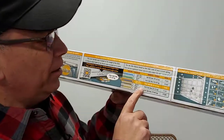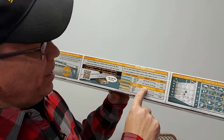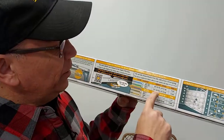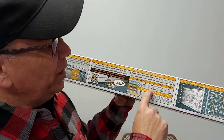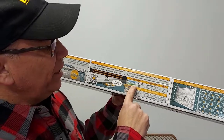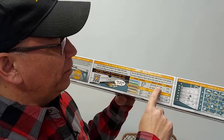I did that — my garage doors were around 140 pounds. Once you weigh your door, you can go online or just go by this video. Mine was 140 pounds, so it takes a dark blue spring. If you have a door that is between 115 and 125 pounds, it'll take a green painted spring. If you have a door that is 85 to 95 pounds — must be a pretty small door — it'll be painted light blue.